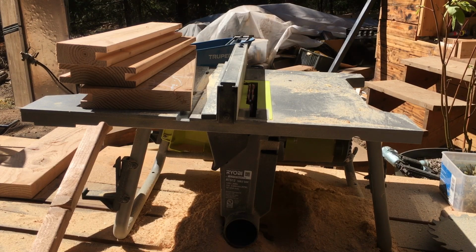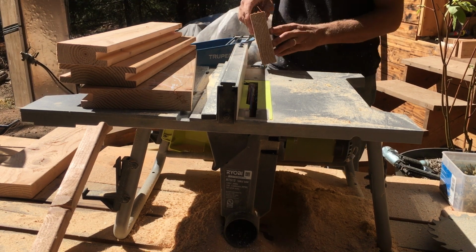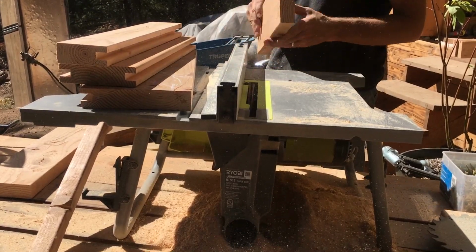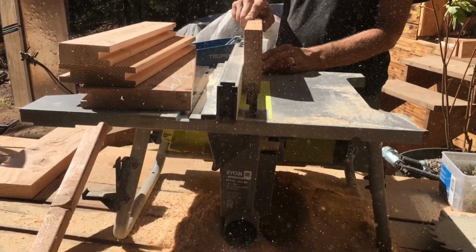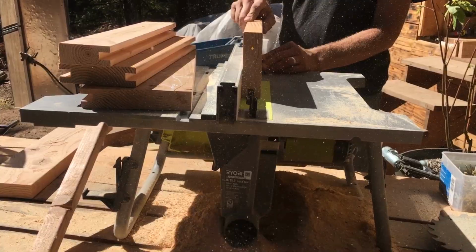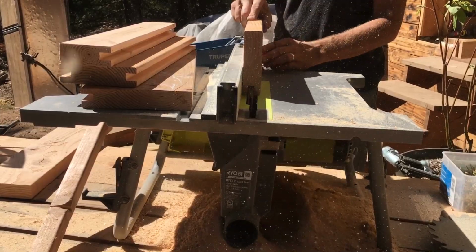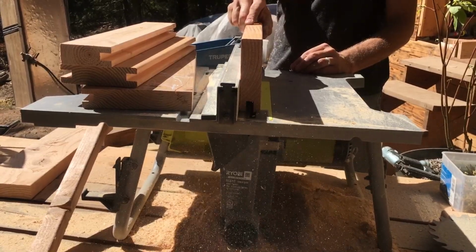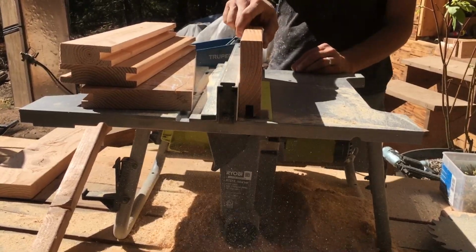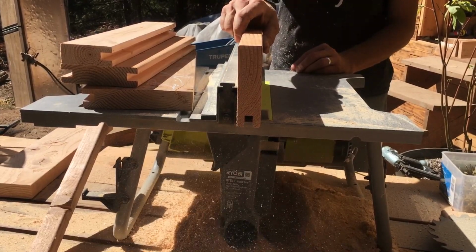The three pieces we're working with here from top to bottom are the header piece or rail, if you will. Then the middle piece there is a 2x6, and that is the middle rail, which will hold the glass above and the door panel below. And then finally is the kickboard or the lowest rail of that door piece. And then here I'm just giving a different angle so you can see the way the dados channel the edge of that 2x material.